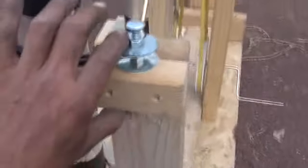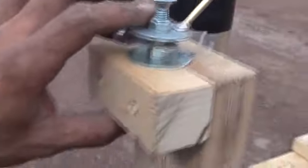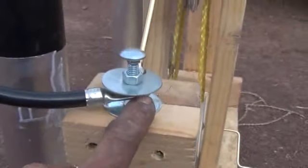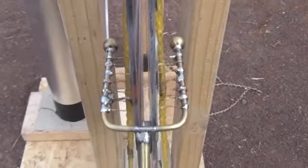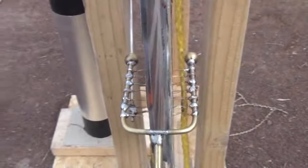This bolt is insulated because of the wood being an insulator — it's just a 2x4 and a 2x2 with a hole drilled through. I've got a nut on the bottom of the bolt so you can tighten it all down. I've got the cable lug running up to our negative capacitor and the washer with our comb sitting on it. Now you can see the comb positioning — it's done really well. They're positioned just off the surface of our disc on either side, if I can give you that aspect ratio.